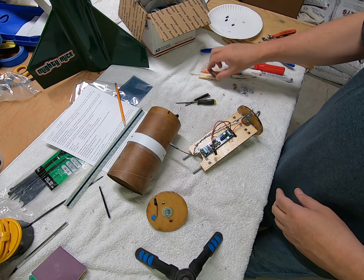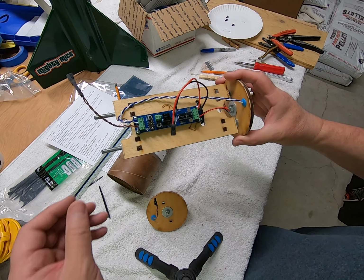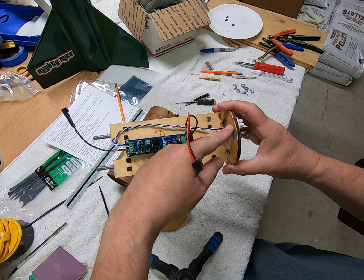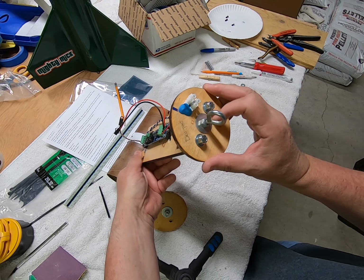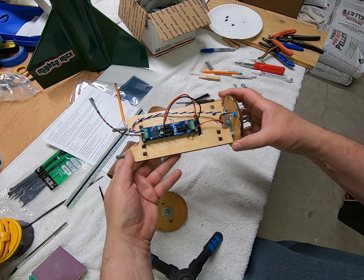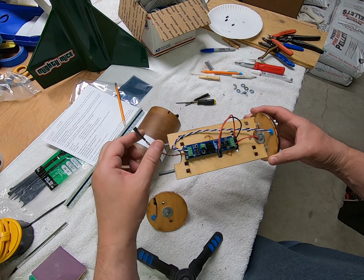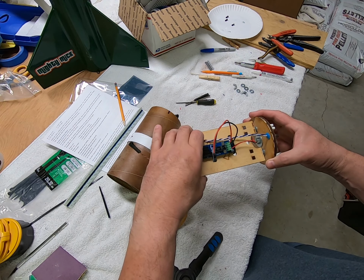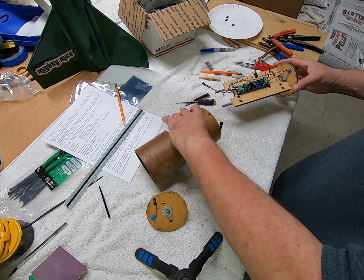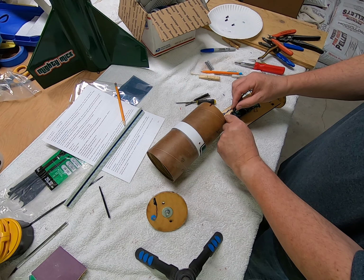Yeah, I think the electronics bay is all ready to go. So I can show you how it's laid out here. The drogue wires going back to the rear, the aft end, sealed up. I've made a match mark here so that when I put it in the tube, I know which orientation I want it to be in. This is the connection to the forward bulkhead, the main parachute charge. So the way it's symboled is match mark. There's the match mark.